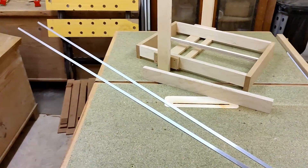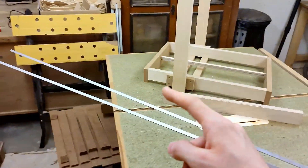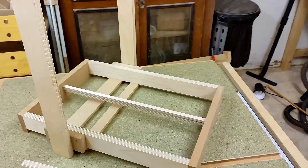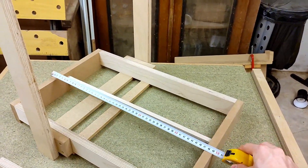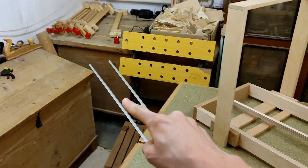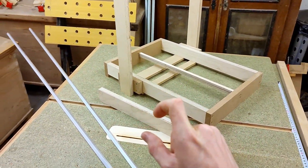The first thing we need to do will be cutting them to the same length as the respective axes of the machine. I have four meters of the stuff in total, and with each of the axes being below 50 centimeters in length, I have two pieces for the Z-axis eating up the first meter already, and two for the Y-axis as well as two for the X-axis. It's pretty spot on.